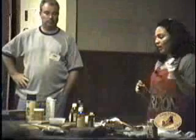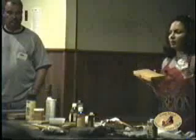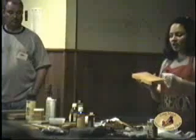If it is too dry, you will have drag marks, and again, there's no correcting it. If it's too wet, it will be a mess. So it's very important to keep it exactly well prepared. There's a good picture on that level how to do that. You're going to take your surface, and the key to French polishing is you never stop on your surface. The second your pad stops, you have a mark, and again, no correcting it. So you kind of swoop down on your wood and swoop up.